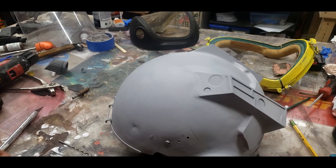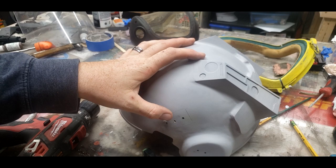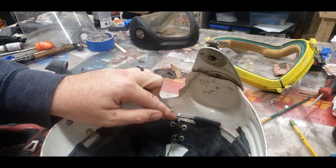But there's a lot of different rotor broach sets you can use to make these holes. Now, you can also buy metal hole saws. I don't know that you can find them that small, but you can also just draw your circle how big you need it to be, run drill bits around the outside of it, and take a file and clean it up. Or if you have a set of giant drill bits, you can just run a hole straight through. The issue with this, though, is that right on the other side is this liner, and I don't want to damage the liner, but because of the stopper that's on it, it'll prevent it from cutting into this liner.